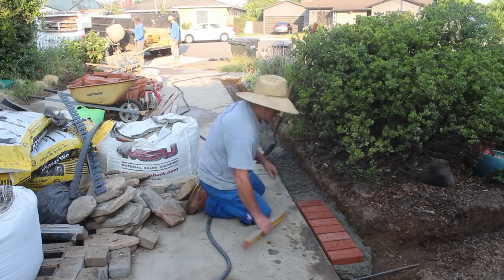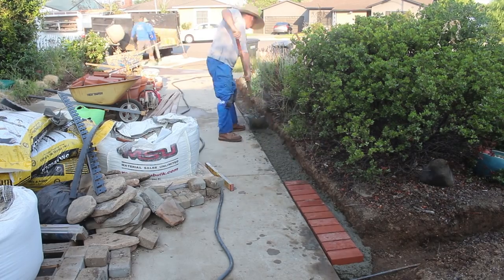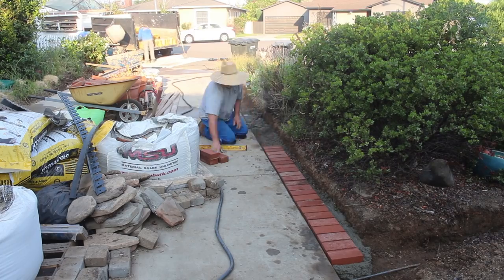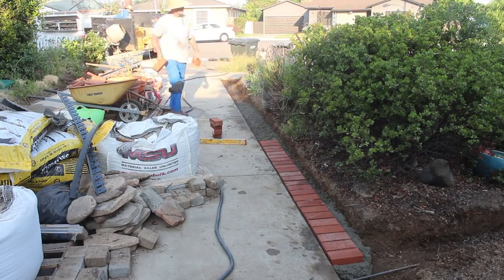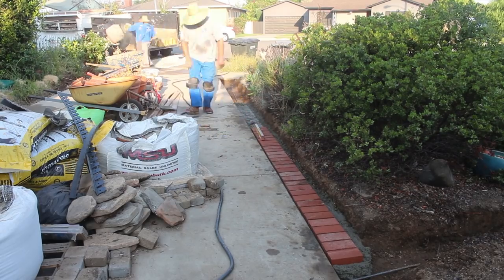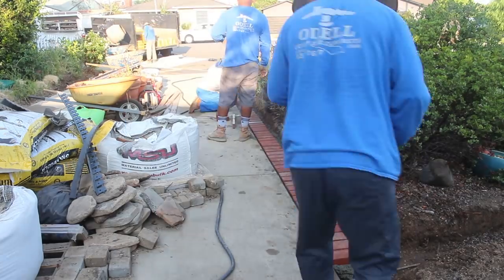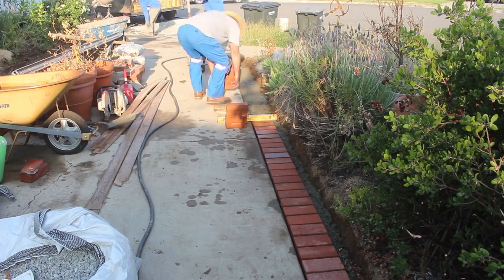When you're doing a wet brick setting, a crucial part is soaking the brick in water. That's going to avoid flash drying and prevent it from not binding to your footing — it gives you a little more time to get it set. What I did is take a wheelbarrow, fill it with water, and throw all my brick in there. I've got a couple of wheelbarrows full of brick and water and I just pull them out as I need them.